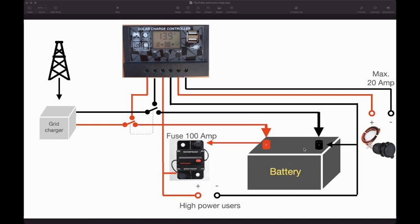But not through the controller. In that case you are responsible yourself for too much discharging the battery. So the fuse of 100 ampere must be connected with the correct polarity — the BAT goes to the battery and it will protect against too high currents, which can be very dangerous. If this trips you can close the red lever here after you have resolved the problem. And the red button is to disconnect the battery anytime you want.